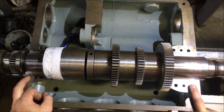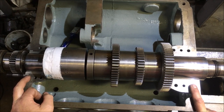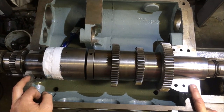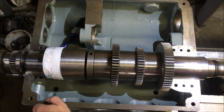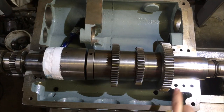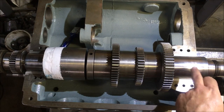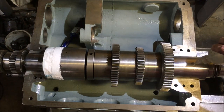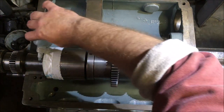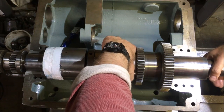I've got it to a stage where I can't get higher points per inch using the kit that I've got with my technique. And one of the bits of advice I got from a chap called Chris was, once you've got it to that stage, clean off the bluing, add a very small amount of thin oil, and then basically run the journals, run the bearings. So I haven't got thin oil, so I'm using white spirits, which I think the Americans call mineral spirits.